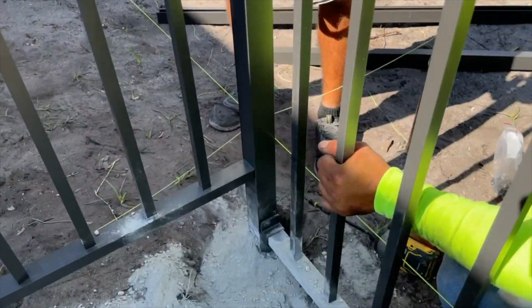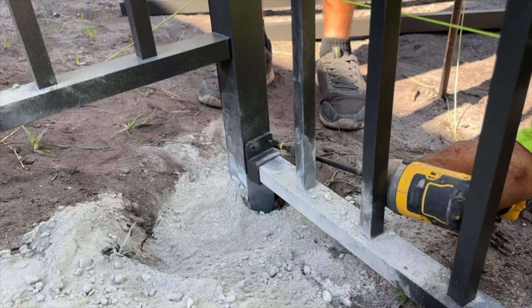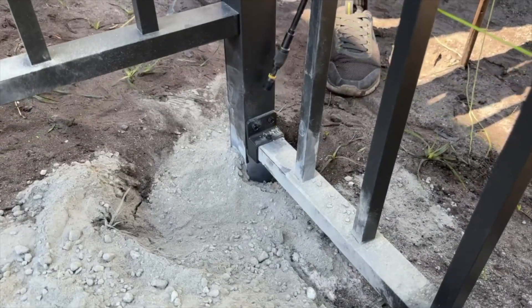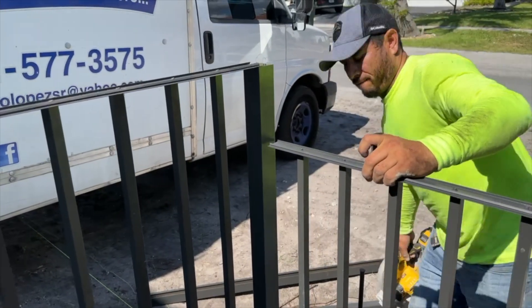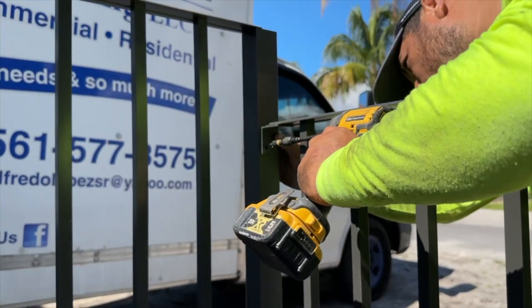This installation is on a slope and turns 90 degrees, so the fence has to step down. An end receptacle is screwed to the aluminum corner post with self-drilling metal screws to lock the bottom in place. The top panel needs a little more adjustment and is cut in place to fit. To provide a cleaner corner finish, an angle is secured underneath the top post.